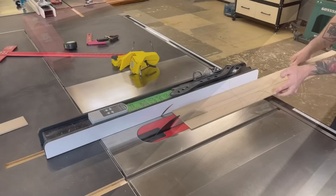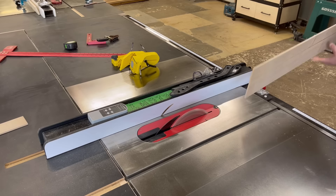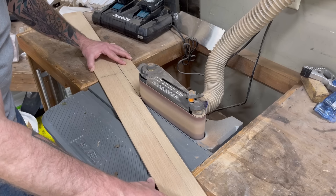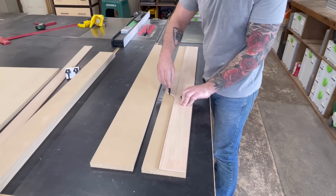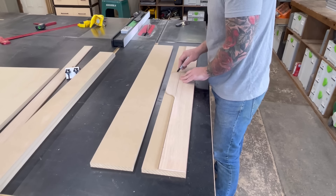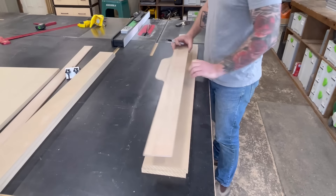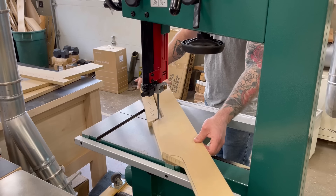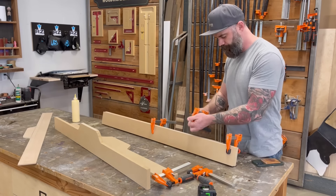I traced out the shape I wanted for the back fence onto a scrap piece of quarter-inch plywood to use as a template to transfer that shape onto my pieces of MDF. I cut partway through on the table saw and then went over to the band saw to cut out most of the excess material. Then I finished it up on the oscillating belt sander until I had a very nice-looking template — the exact shape I wanted for the back fence. With that done, I traced that shape onto my rough pieces of MDF and cut away excess material on the band saw so that when it comes to template routing, I won't have to remove so much material with the router bit.